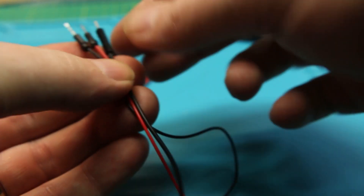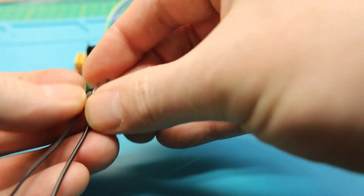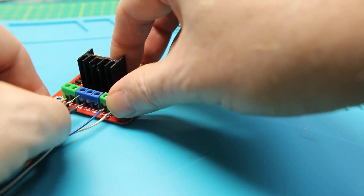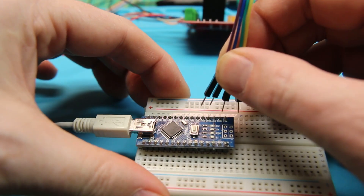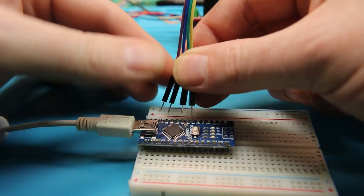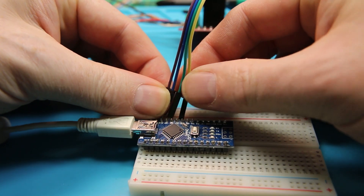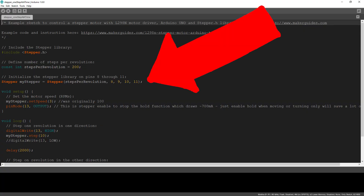You can use whatever kind of wire you have kicking around. I have these breadboard jumpers — these wires are plenty good enough for the amount of current we're going to be drawing here. These four wires are the ones that go between the module and the Arduino outputs. In my case they're pins 8, 9, 10, and 11, which you can see outlined in the code linked below.